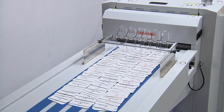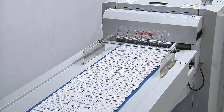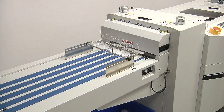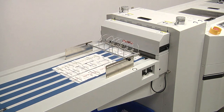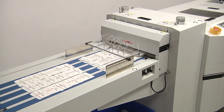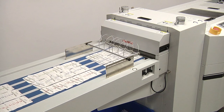The RDC Flex delivery has 4 important features to minimize operator workload and enhance productivity when running business cards. The operator can adjust how cards are shingled on the delivery conveyor by adjusting the conveyor speed. The delivery conveyor is 36 inches above the floor, reducing operator back strain. The 48 inch long delivery conveyor improves product collection, and the conveyor features a programmable batch surge to separate individual orders.